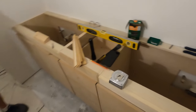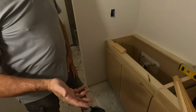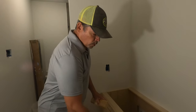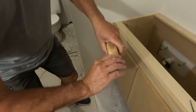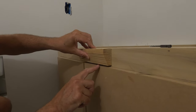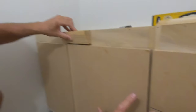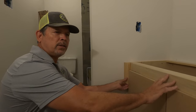Let's go over here by the vanity and I'll show you what I did this morning. This bathroom is going for a kind of modern look, and these cabinets were custom made by a local young guy just starting out — did a great job. My wife gave him the plans for a flat door. You see this profile piece right here? That gets applied on all four sides, the reveal will match the reveals between the doors and drawers. It all gets painted a nice cobalt blue, and we'll use our airless sprayer for that. We're going to build this frame outside and then apply it to the face of the cabinets.